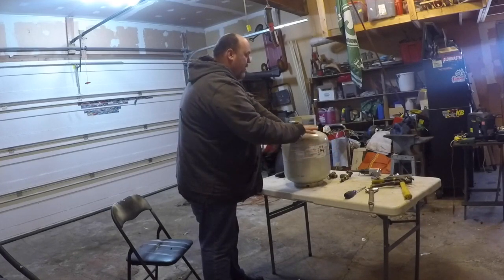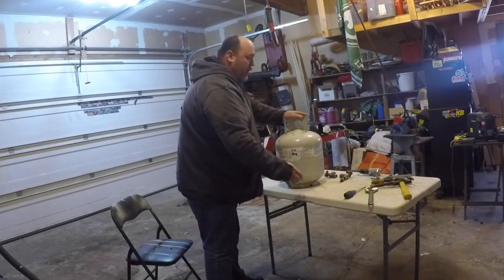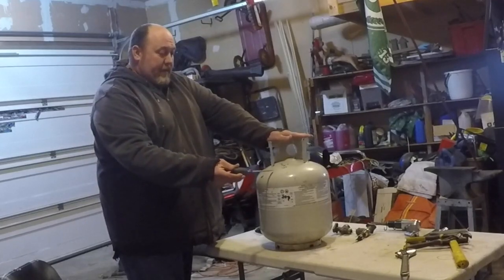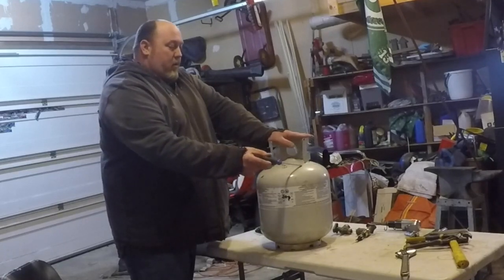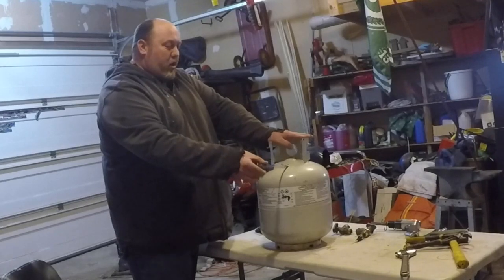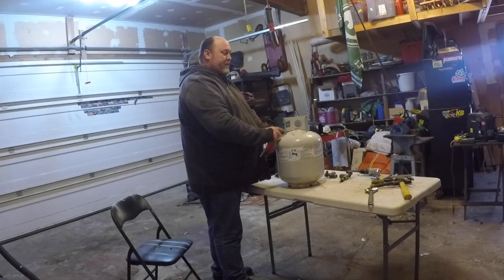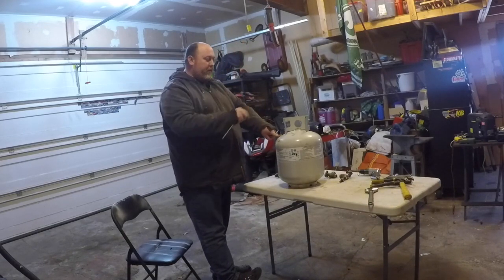So we're going to figure out how to do a cut here. Because I want this sealed quite well, I want to cut this way, not this way. I don't want to cut here, I want to cut somewhere it's at its greatest curve. So when I cut it, there's going to be overlap, and that's just going to be the sealing surface, and then I'm going to have a hinge. So that's what we're going to figure out right now.